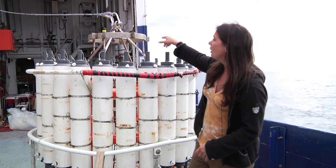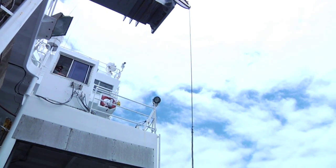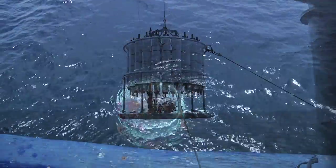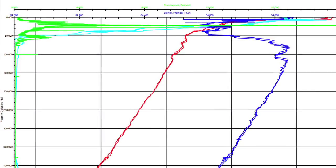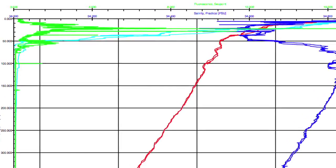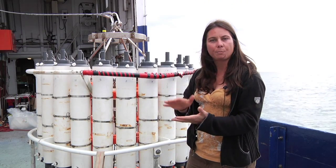So how this works — we've got a line, you can see it's a big metal line, and it's connected to a winch. The whole thing gets picked up, dropped overboard, and attached to this line. It's sending data to PC monitors inside the lab where we can look at real-time temperature, real-time depth, and real-time fluorescence. So we get phytoplankton biomass, all sorts of other properties — scattering, so we get particles.